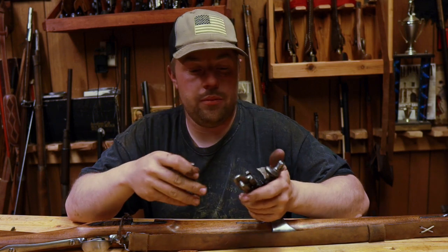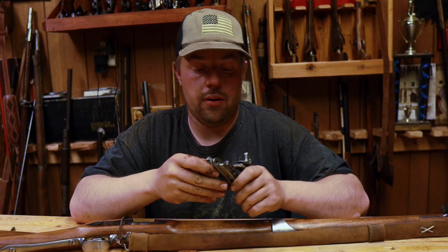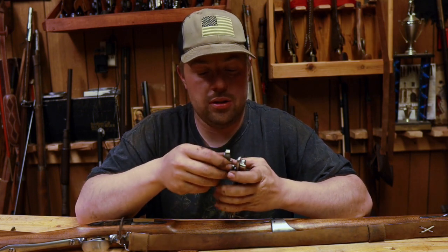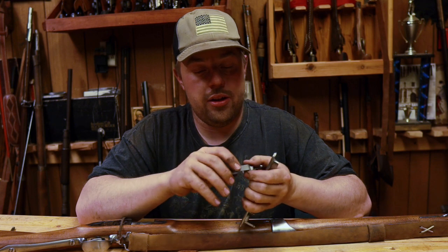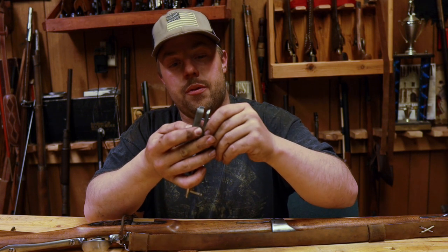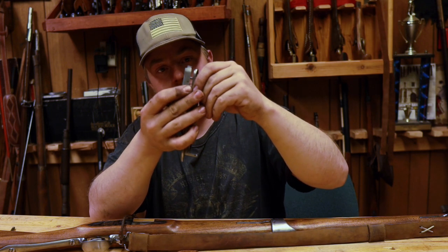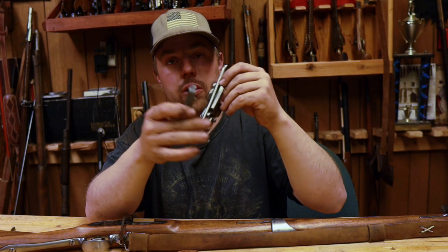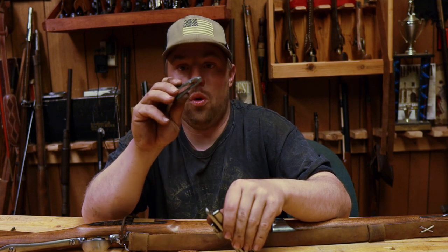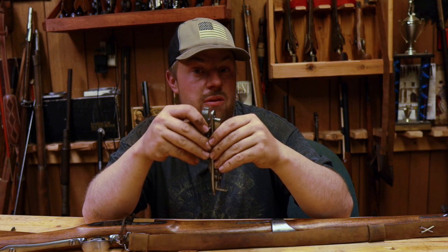The new spring is from the Rifle Shop. Our first hurdle is that I already had to drill out the hole for the screw because that hole was a little bit small. This spring is going to work beautifully except that when we line up our screw hole, our front pin hole is just about a hole and a half off from where it should be. This is actually a pretty easy fix because the spring is so wide — it will cover up the old hole and we can simply drill a new one right in front of it.